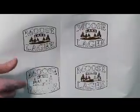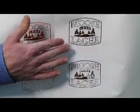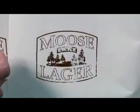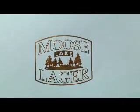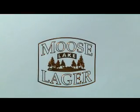Okay, so you can track our progress here. This was the first stamp we did as the preliminary stamp, and we identified where we needed to build up. After we've built up with the spot make-ready tape and the epoxy glass board, you can see this one is complete. This is a good stamp. Everything's cutting nicely there as far as the foil is concerned. Very clean. Down here we still have some other areas that we need to do some spot buildup on, and we'll continue to do that with the spot make-ready tape as I just demonstrated until it gets to be perfect. So after doing the spot make-ready on this particular image, we were able to get a perfect stamp, where we get good coverage and nice clean cutting foil in those areas.